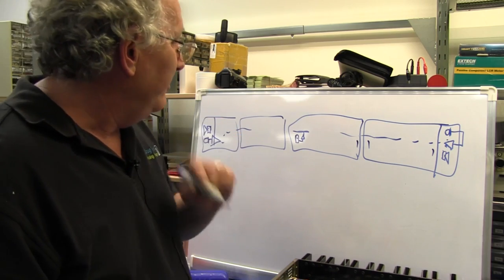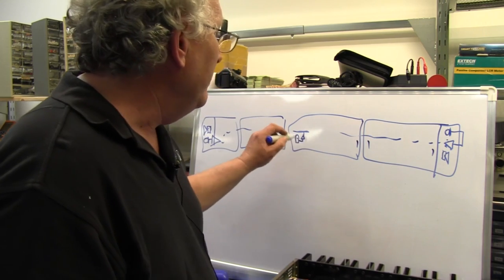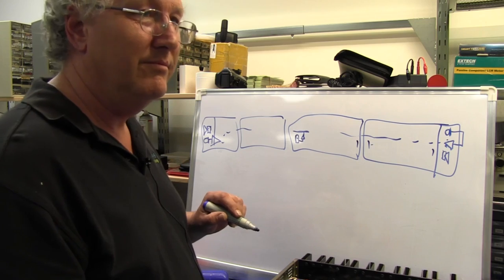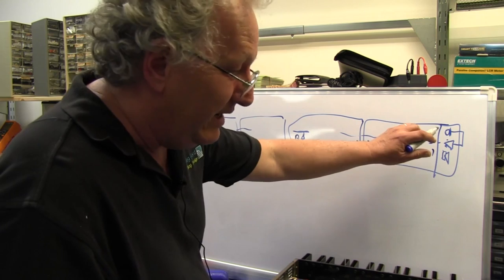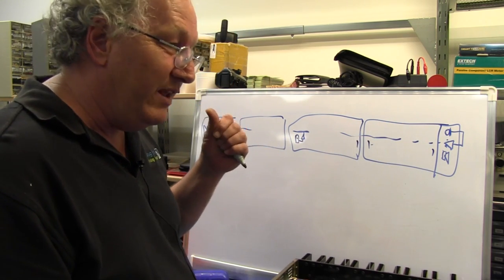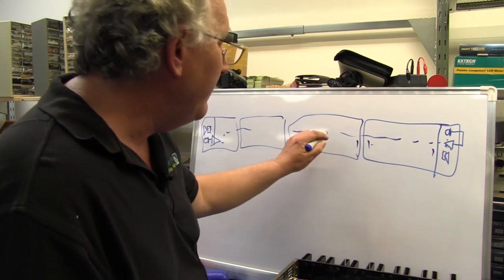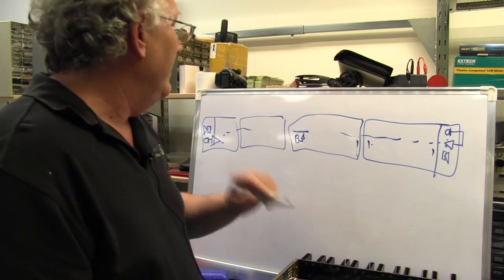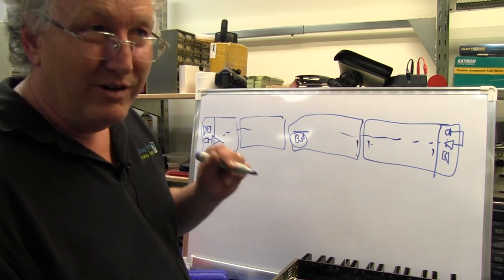Excellent. Now, similarly, how do they reply to just him and not to that one and that one and that one and that one? Because you don't want to panic the rest of the train. Exactly. When the crew want to reply just to that help point, they press their passenger emergency intercom button and they're putting audio back down that line plus a 50 kilohertz tone. The 50 kilohertz tone is detected by only the one who's had its button recently pushed.